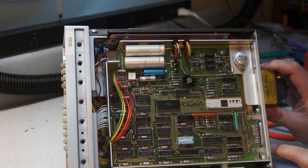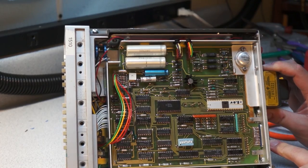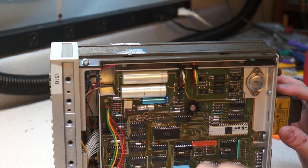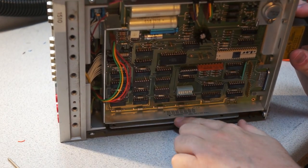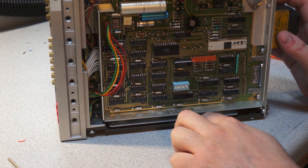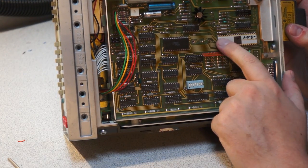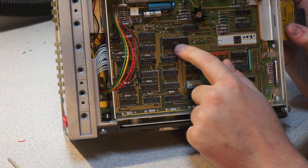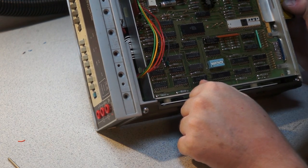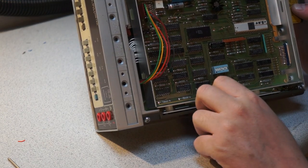You can also see some good stuff down here, like these huge metal brackets between the PC board and the HPIB interface connection, just to make this a really strong, rigid connection. Oh, look. Down here, this DIP looks like it sets the HPIB bus address. Here's kind of a close-up of the PCB. You can see something written on there, that's probably the DMM or the control ASIC. That is a MOSTEK MK34127. I bet that's the CPU, or a dedicated controller ASIC.